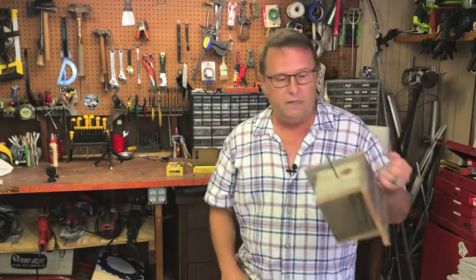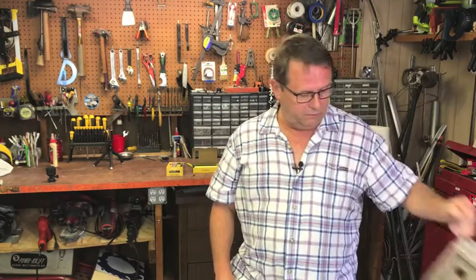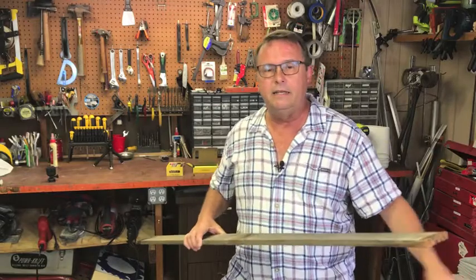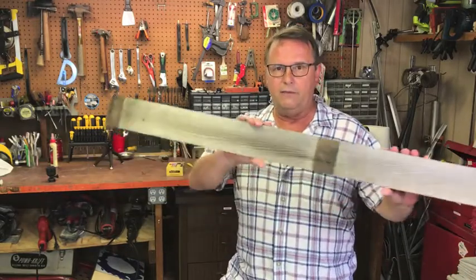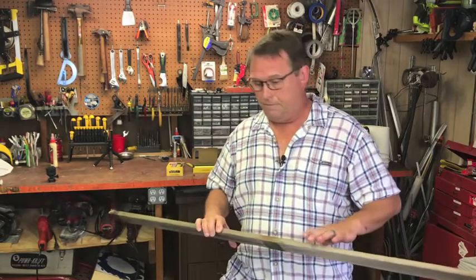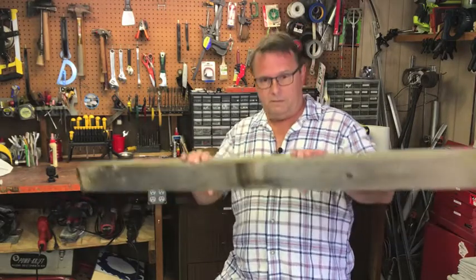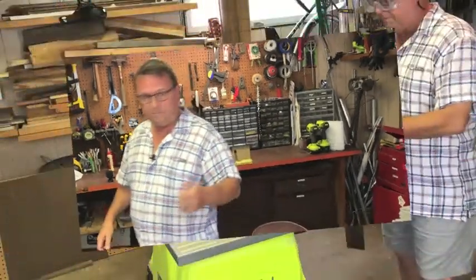Here's a sample — we're going to build one of these right now and it's very simple. It's only six pieces of wood and two little metal things, so eight pieces total. In order to get the size I need for the sides, front, and back, I have to glue two of these together. To do that, I have to run them through the table saw and rip the ends so they're nice and straight for gluing.